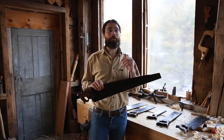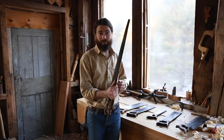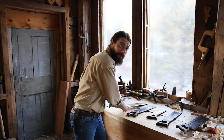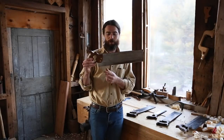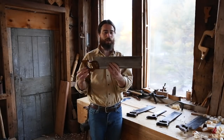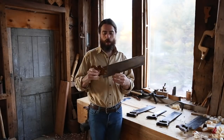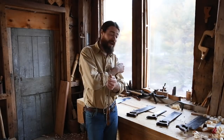When you're thinking about back saws, you want a saw that's about 20 thousandths — half the thickness of a rip saw — and shorter and smaller. This is my rip hand saw, and this is what we call a tenon saw: a rip-filed back saw. It's filed the same way. If you remember from Mike's video, a rip saw is filed directly across, as opposed to diagonal like cross cuts. This saw plate is approximately half the thickness of the other one.